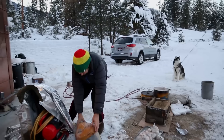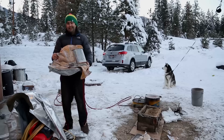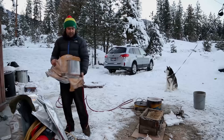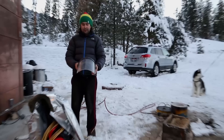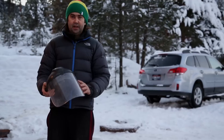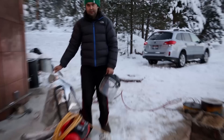I also have a proximity helmet here — maybe more for casting steel or something — but it protects my hair, face, and neck when I'm casting. It's just an added layer of confidence and insurance. If you don't have a proximity helmet, please at least get a face shield like this — there's just no excuse for not having this on. If the worst happened, it would save you from lifelong traumatic scars. That's basically the equipment overview. The last thing we need for the process is an air compressor, and we'll show you how that's used when we get into the actual casting process.